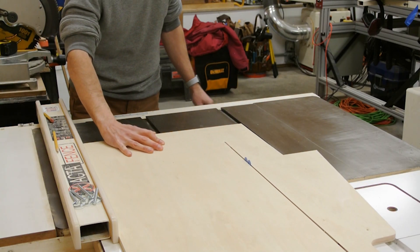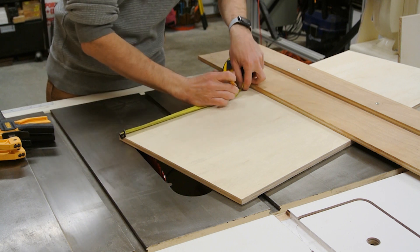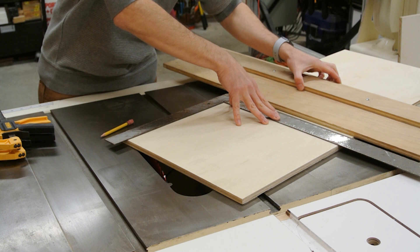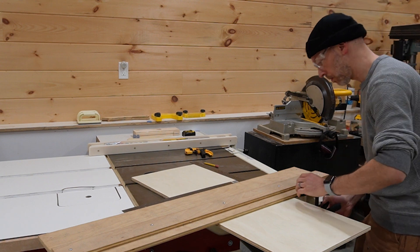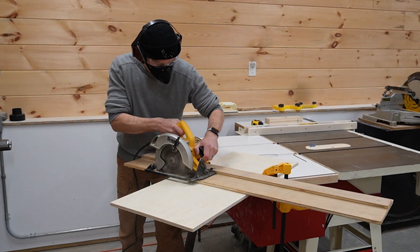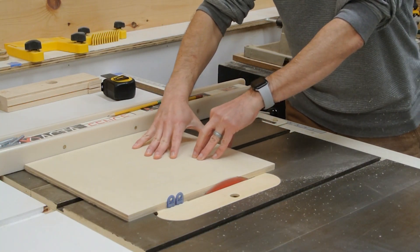What I love about projects like this is that you can make them out of leftover scraps. I had one straight edge on this piece so I was able to rip it to width on the table saw, but I didn't have a square corner so I set up my homemade circular saw track. I used a framing square to make sure the track was properly positioned and then clamped it in place. After making an intentionally oversized cut with the circular saw I then cut the final dimension at the table saw.